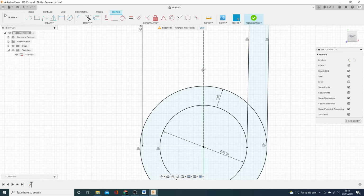Let's look at it. So, as is traditional, we'll start on creating a sketch on XY plane. So, as I said, this is going around a roll cage bar. So first off, we'll model the hole for that. And we'll say it's 38 mil in diameter. And to be fair, I think we've got the scales a bit wound up. But there you go, 38 mil.